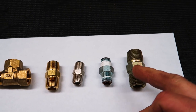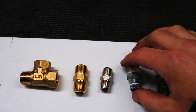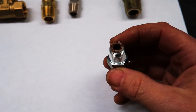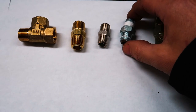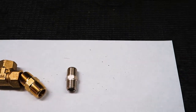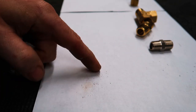These two right here are zinc-plated steel fittings. They're typically used in hydraulic fittings, which is fine because hydraulic oil prevents the inside from corroding. If you look at this used fitting, you can see quite a bit of rust building up on the inside — even though it was zinc plated, it has started to grow. What will happen is that rust will get clogged in your valves and make your valves start leaking over time. You can take a pick and rub it around the inside and see all the junk coming out — that's what gets stuck in your system.